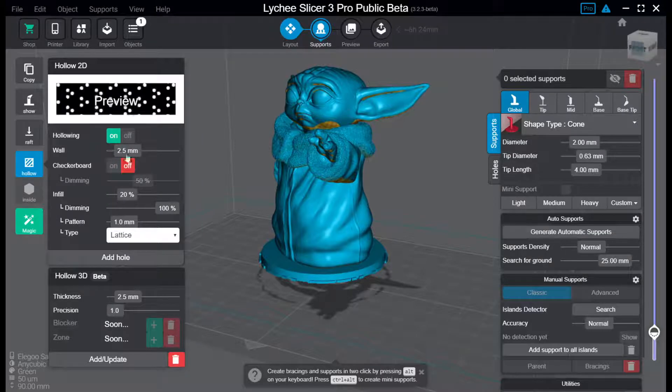You can also decide if you want to have some infill. It will create a little pattern inside to help stabilize things — either 0%, or sometimes around 20% is good to have. And then you can also decide what kind of pattern you want. This model actually works just fine without infill altogether.